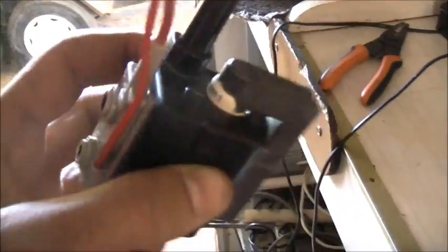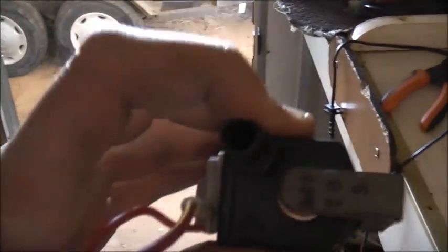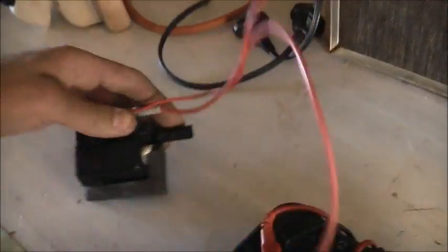Okay, if you want this little modern flyback — I got it donated in that box of goodies a while ago. It has one of those clipping-type leads. I completely clipped it out and stuck it on the back. That's my NST wire. It's a 30 kV rated one. I've run out of these little anode caps, so it's the only one I've got.